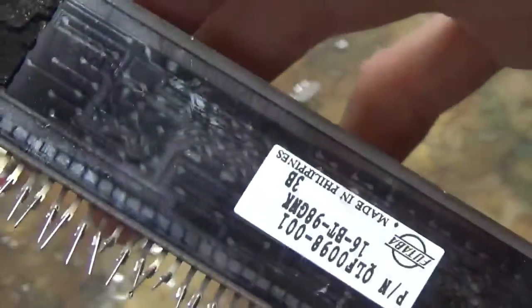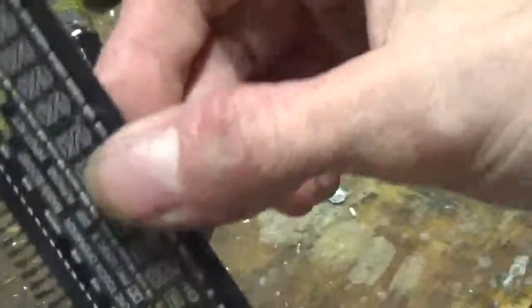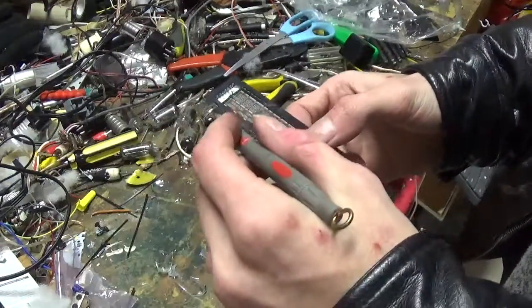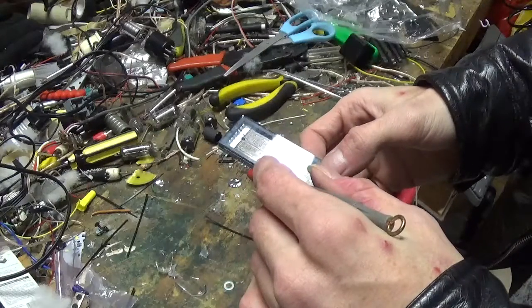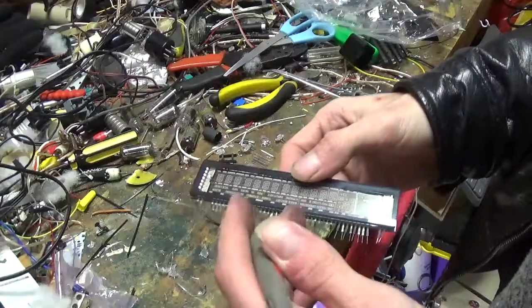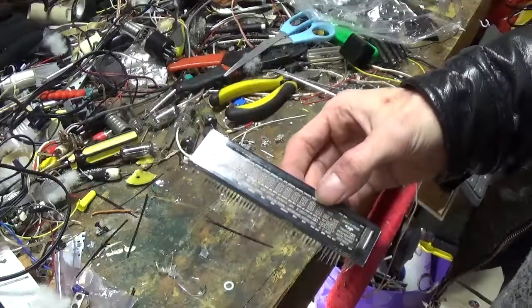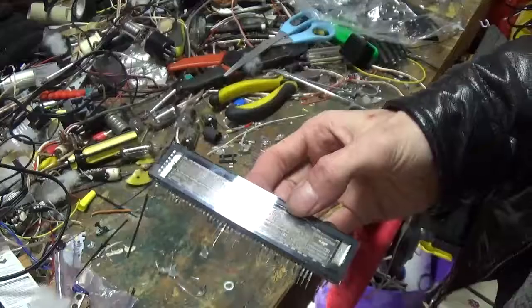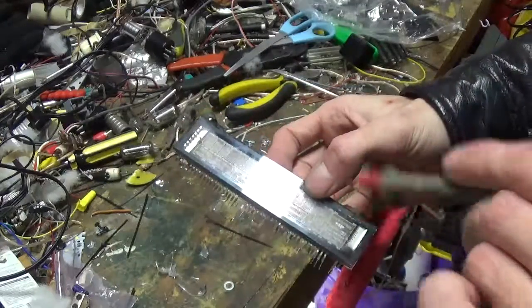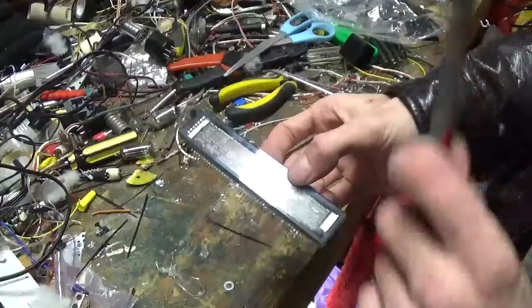You even got all the little wiring that runs all the segments. If you look it up on YouTube, you can find people who've actually converted vacuum fluorescent displays into audio tubes by combining all the screens together, all the plates together, and all the control grids together independently, and then ran it through with an audio signal in and out. And then of course the heater is these two wires here and these two wires here. Those heaters are all connected together. This has a broader span of heaters because of the way it functions and it's spread out. So it's got to heat the segments along lengths instead of just one central heater in the middle going around like a spiral or whatever.